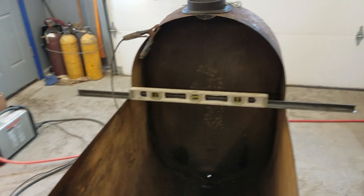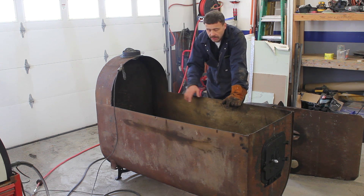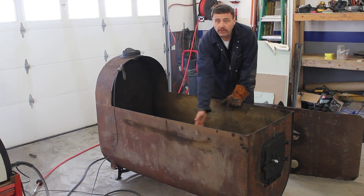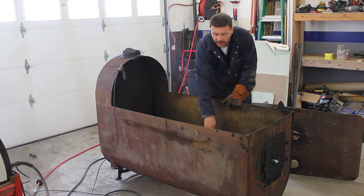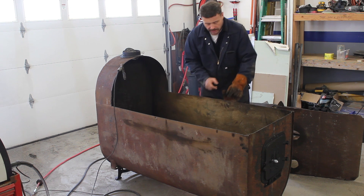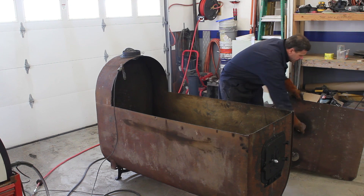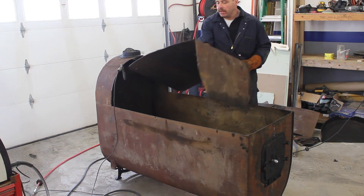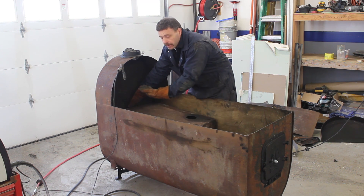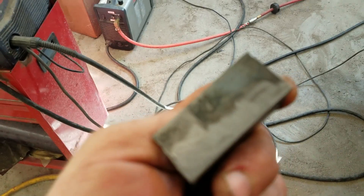The shallow side, when it gets closer to syrup, could end up burning. If we were to make fire in the whole thing, that would use a lot of wood and be hard to tend. What we're actually going to do is have the firebox in the first half towards the door, then there's going to be a divider — the bulkhead — that will taper up towards the flue underneath the pan. The flue gases will taper up under the pan and go out the flue. I've made some brackets out of angle iron to weld onto the inside.